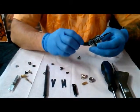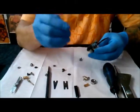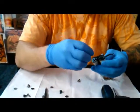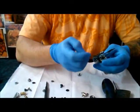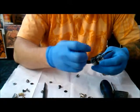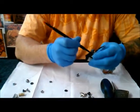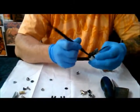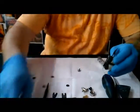Once you have the coils exposed like this, the core bottoms, you may as well go ahead while you're at it and drop a small little ball of steel wool into the core bottoms. Then you can go ahead and pack it down in there with something plastic, to avoid scraping or scratching inside the coil core.